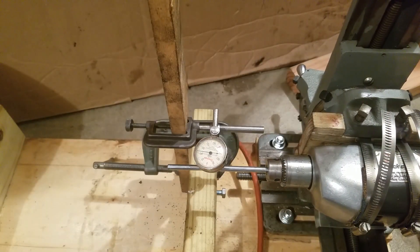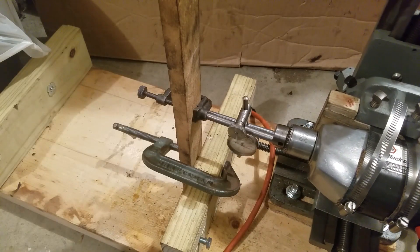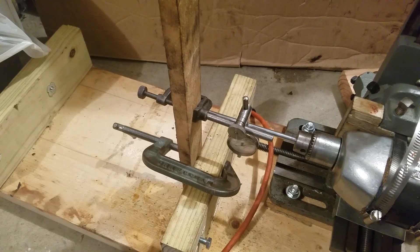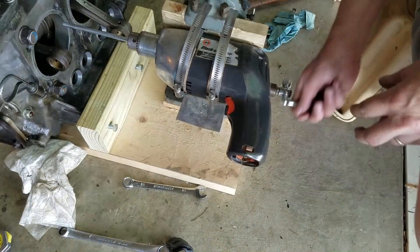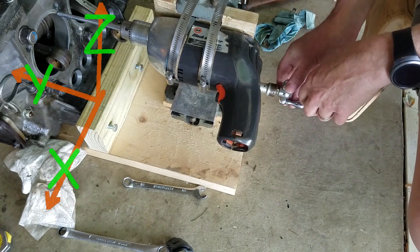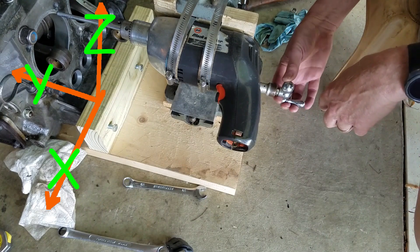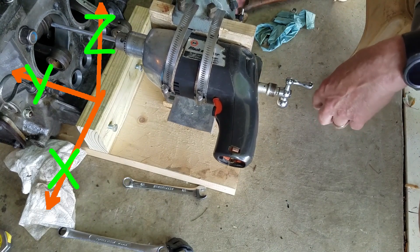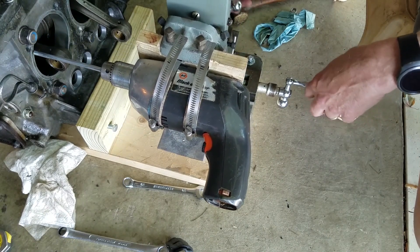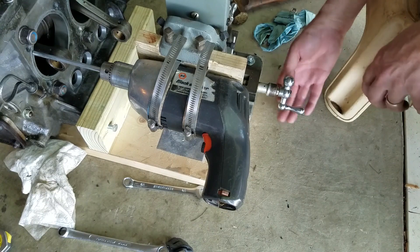My first adjustment is to make sure the drill bit is absolutely parallel with the Y axis of the drilling attachment. I chuck a straight rod into the drill and watch the dial indicator as I move the drill in and out, adjusting the angle until there's no change in the indicator. Then I clamp the crankcase into the fixture so the cylinder base is absolutely square with the Y axis. I use wedges and adjustment screws while checking the clearance between the drill rod and the cylinder base adjacent to all four stud locations. Since the Y position can be measured to one thousandth of an inch, it's simply a matter of checking all four locations, adjusting the crankcase, and repeating. After 5 or 6 iterations, all four points are within a couple thousandths — which is good enough.